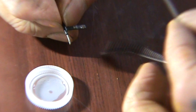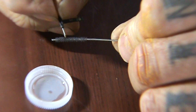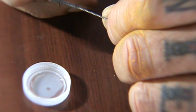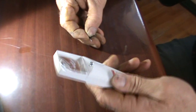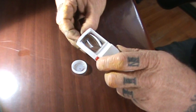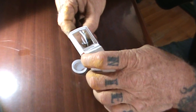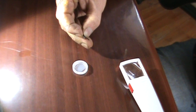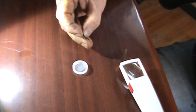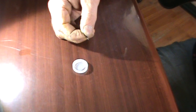If it seems like it's really dirty, you might want to invest in one of these little detail brush kits and just kind of swipe across it — that will drag the dust off the needle as you are cleaning it. Another thing I have here is a magnifying glass that has a light on it. It's also got a macro magnifying glass which will give me an even better angle. I am going to look through my magnifying glass to see if the needle is now clean, and as I look at it I can see that there's still a bunch of trash left behind. This is why it's very important to clean your needles on a regular basis.